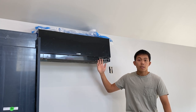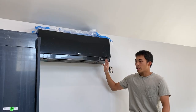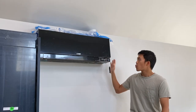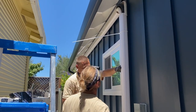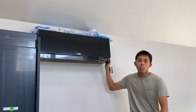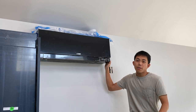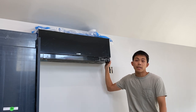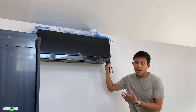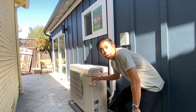If you want individual room control, you go with a ductless mini split system, which is what we have here. This is an indoor unit — it's the same concept as central air except you run the line set on the exterior of the walls rather than inside them. Each indoor room you want to control gets one of these units, which you can turn on and off individually. The benefit is energy savings since you don't have to heat or cool the entire house, but the downside is that the indoor units are more expensive and the overall installation cost is higher than central air.